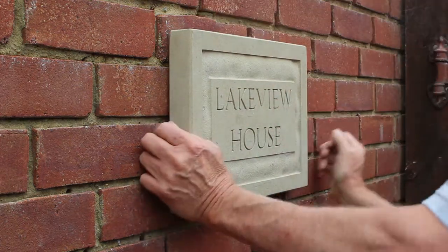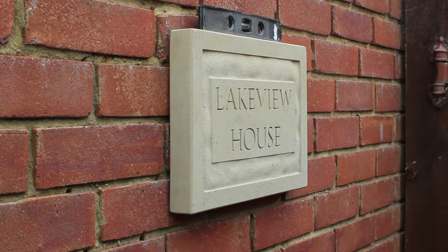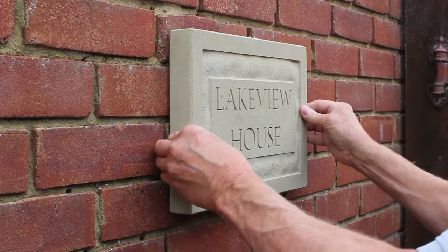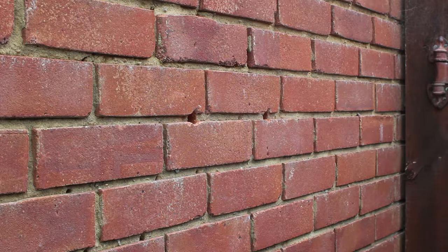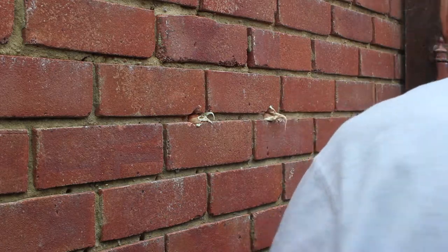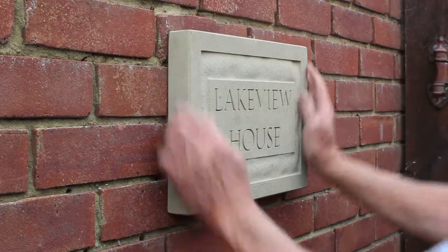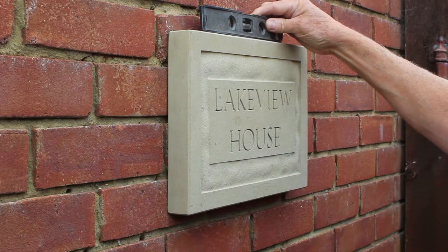We offer the sign up — it drops back to the wall. Trial level: it's perfect. That's hanging there perfectly solidly now and would stay there for a hundred years as long as you didn't lift it out. To finish off, we're simply going to use a no-more-nails type adhesive, exterior grade. Fill the holes up, push the sign back into place and back to the wall. Check the level — perfect. Job done.